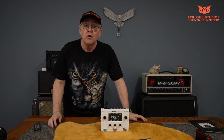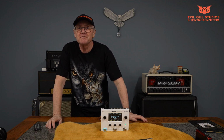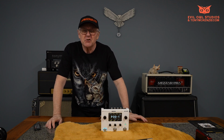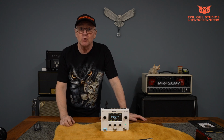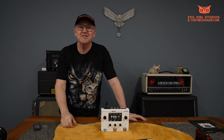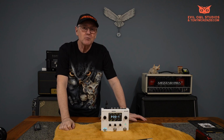Okay, well, there are a couple of words of warning for anybody who wants to follow me down that road. First of all, you'll see that on the PCB that I pulled out, the processor board, there's a small arrow so you can put it back in the right way. And this is important. Listen to what I'm telling you, because you can actually fit that board either way.